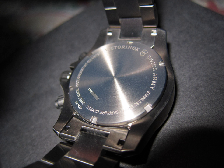Testing diving watches for ISO 6425 compliance is voluntary and involves costs, so not every manufacturer presents their watches for certification according to this standard. ISO 6425 testing of a diver's watch includes reliability under water: the watches under test shall be immersed in water to a depth of 30 ±2 cm for 50 hours at 18 to 25°C and all mechanisms shall still function correctly. The condensation test shall be carried out before and after this test.